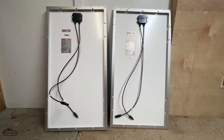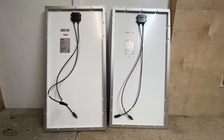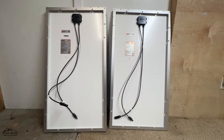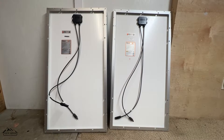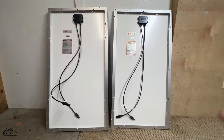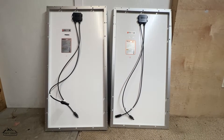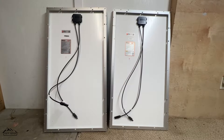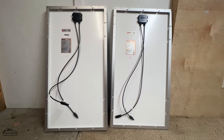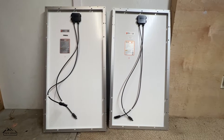Firstly, I don't think you should be connecting panels strictly in parallel — it doesn't really make much sense, there's more equipment needed, and it's just not the best way. You should be connecting all your panels in series unless you have to connect them in parallel as well. At that point you should be doing a series-parallel combination — like two in series, two in series, and then those two strings in parallel.